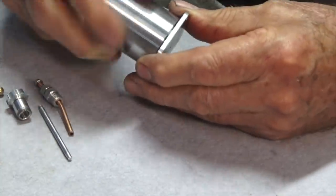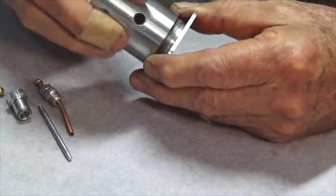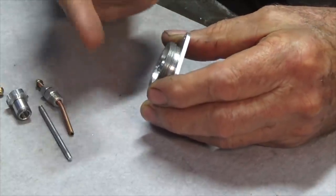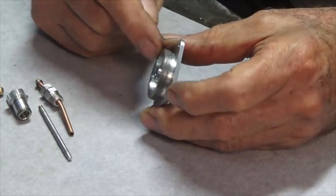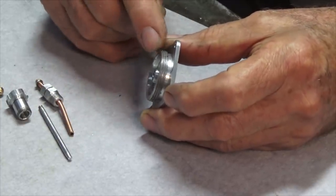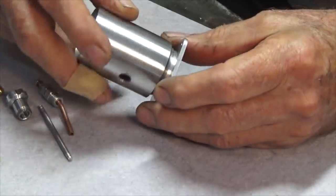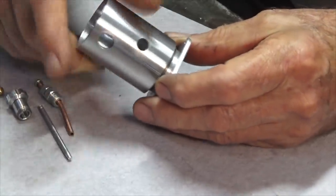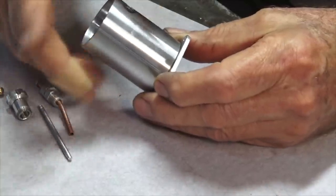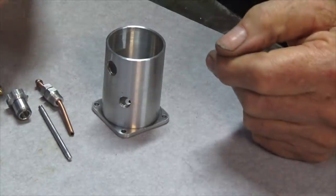Well, the reason was that I need to practice that method of machining away from the chuck using a hard stop on the lathe with the tool inverted. I've seen it done before, and I thought it was a process that's worth practicing. And in this case, I've done it, but you're never going to see it. Once that tank body is glued on there, who cares, really? It could have just been a push fit. But, yeah, I don't know. It's just one of those things. Seemed like a good idea at the time.